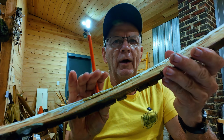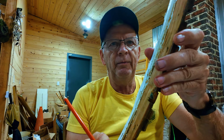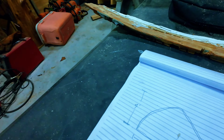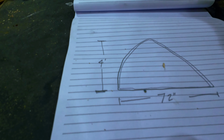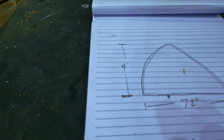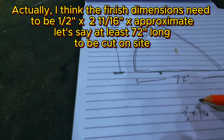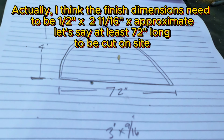Now I'm going to bend it where it's even more than what this curve requires. See, it'll be a whole lot easier to straighten it back out than it will be to try to bend it more. You follow me? You see what I'm saying? So anyway, I'm gonna cut a piece of pine. Have it measured, that looks to be about 3 inches. And I'm gonna make it about 9/16 before I plane it down. So that's the challenge, that's what I've got to do, and that's what I'm gonna do.